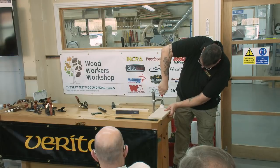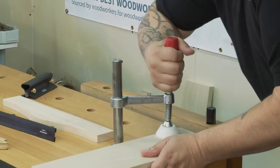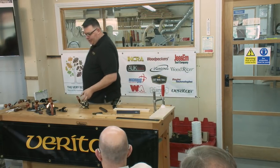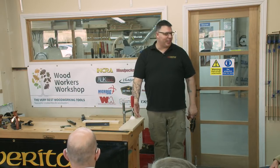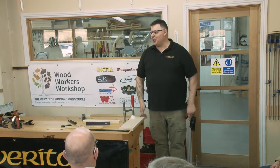Yeah, you don't want to hit your fence. A big part of woodworking is actually being able to hold it. Oh, yeah, that's brilliant. That'll work. Okay. So what Peter says is absolutely true. When you're taking the tool to the work as opposed to taking the work to the tool, it's absolutely critical that you have the ability to restrain the wood. If we tried to do this without this in place, we would end up chasing boards around the bench and it would get quite frustrating, right?